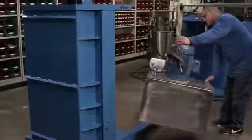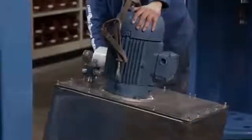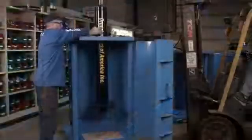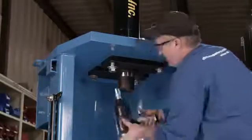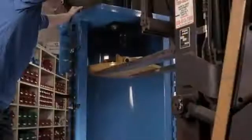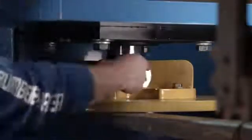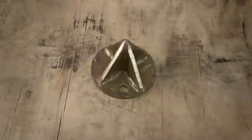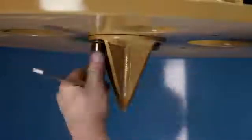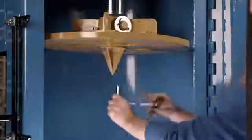To attach the hydraulic power unit, a crane does the heavy lifting as a worker guides it into place at the back of the crusher chamber. Moving to the top, a member of the team installs the crusher cylinder and bolts the retaining plate to the chamber. The substantial and hefty crusher head is next — using a forklift, workers maneuver it into position on the shaft and secure it with a thick steel pin. The head isn't complete without the pierce point. Fixed to the end of the crusher head, it will puncture the drum to drain residual fluids and release air for better compaction.